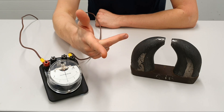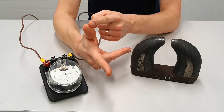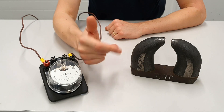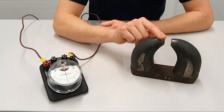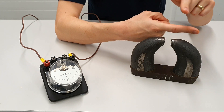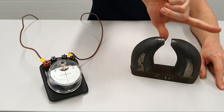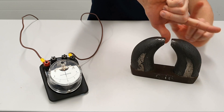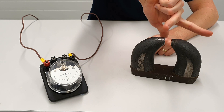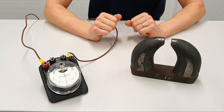What this is telling us is that if we pass our conductor through the magnetic field in a given direction it will generate a current that will also move in a given direction. On our magnet this is the north pole, so we're going to indicate that the knuckle goes at the north — knuckle north — and we point to the south pole. The first direction I'm going to move my conductor in is downwards through the magnetic field, which means the current, if Fleming's right hand rule is correct, should flow in a specific direction through the conductor. Let's prove that by experiment.